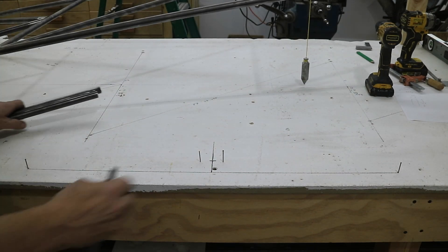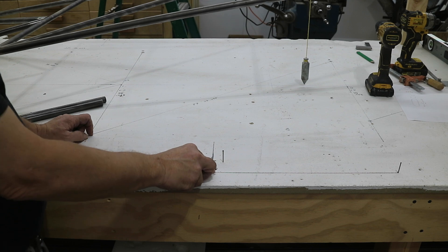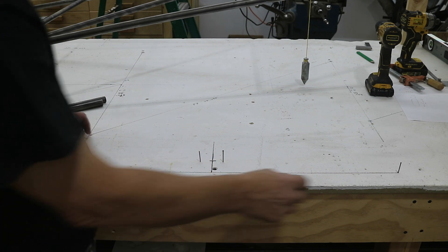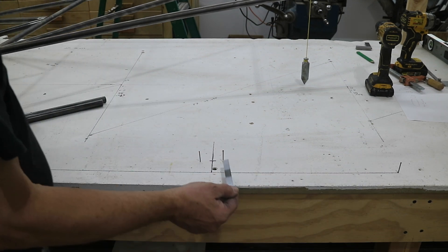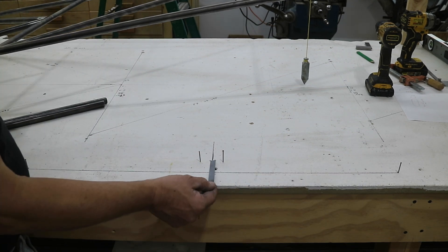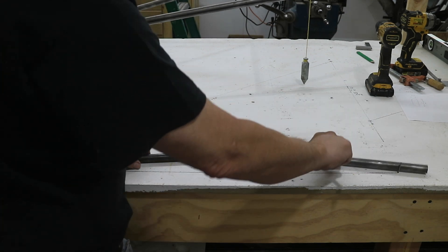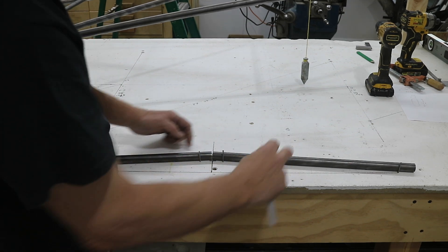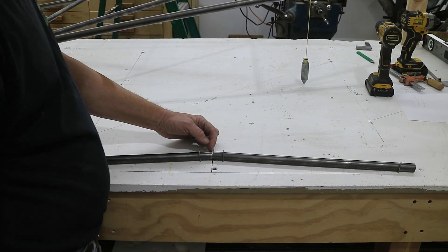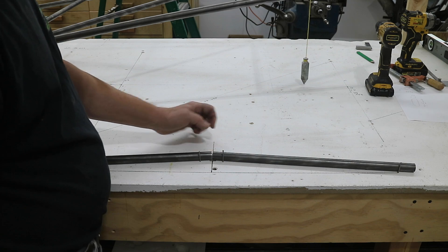To make this little peak on M, it just rises two inches in the center. So what I did was drew out the width, put a nail at the end, and then marked that two inches at the center. I've got a couple tubes so I can line them up on this line. I just need to fix this gap, so I'm going to take them to the belt sander and sand them down until they meet properly. Then I'll tack this together.